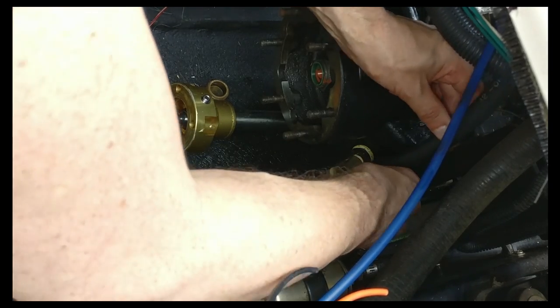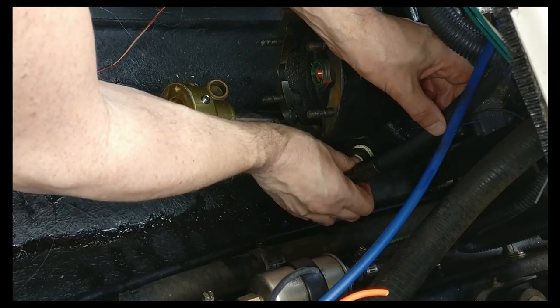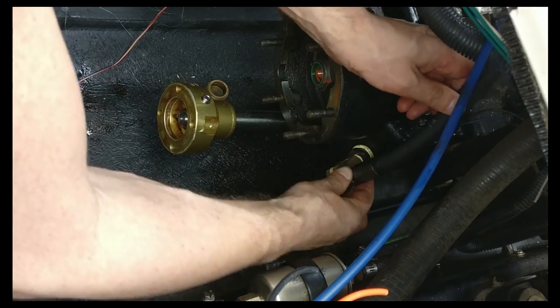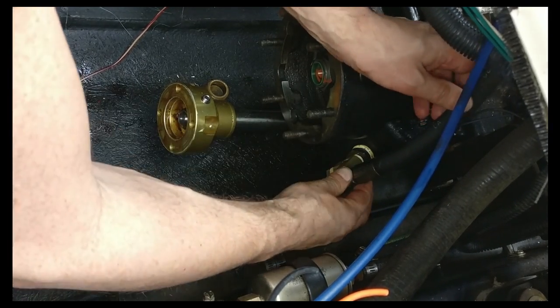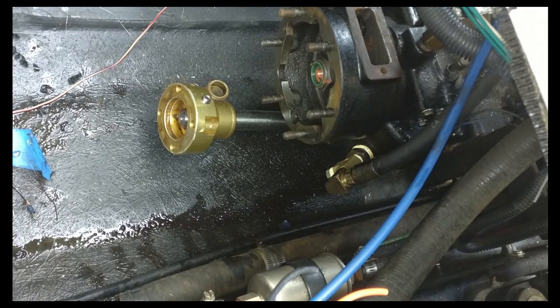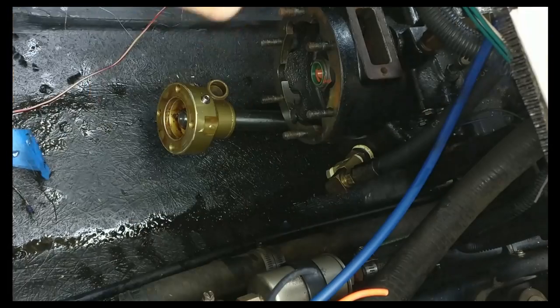It may sometimes be a little tricky because it needs to be exactly lined up. You've got to shake it a little bit to loosen the tension. And you can see there's no stress on the pipe. And now you can use it to just close it in place. You need a 3/4 key.